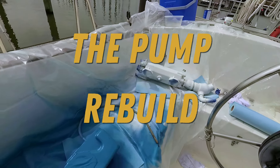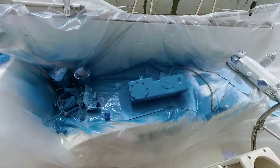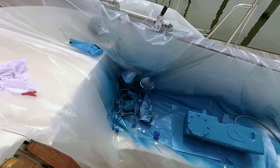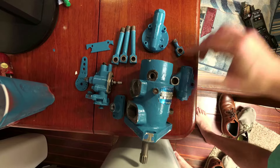With the pump off, I went ahead and refreshed the paint on the parts to help make my engine shine again using diesel-safe primer and paints. If you choose to paint your pump, be sure to mask off the sealing surfaces to prevent issues with paint in the future, because even the tiniest flake of paint in your diesel can clog the pump.